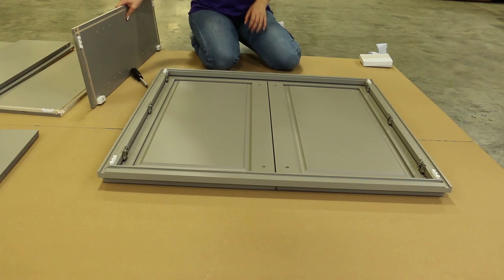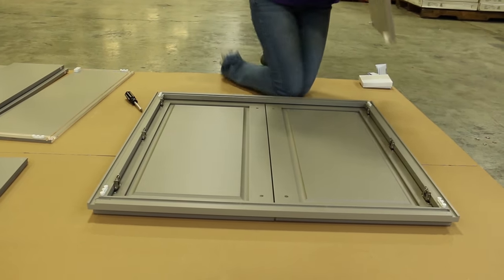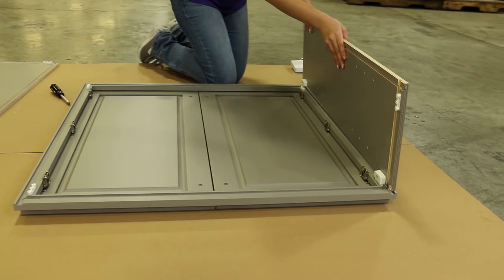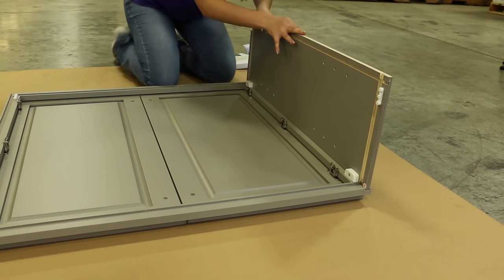Start with the cabinet face frame and attach doors face down on a piece of cardboard, towel, or other surface that will not scratch or dent the doors. Drop the left and right side panels in the dado joints on either side of the face frame and lock them into place with a half turn on each of the cam locks.